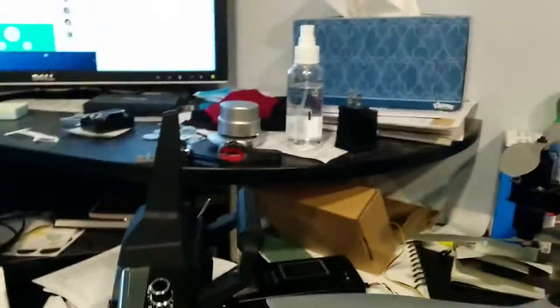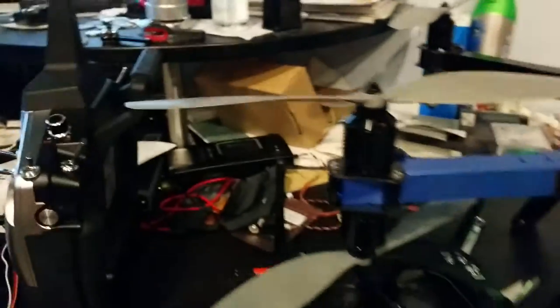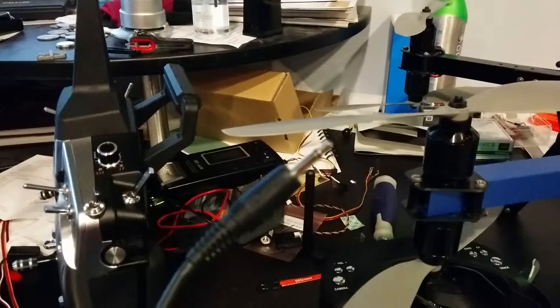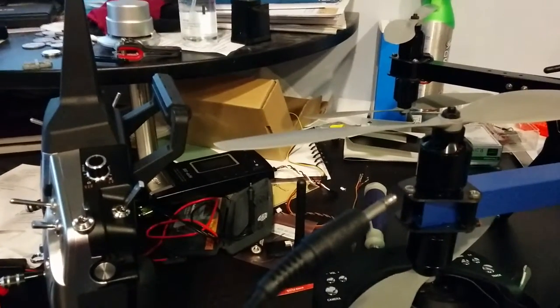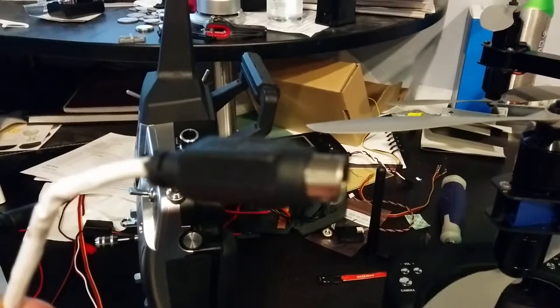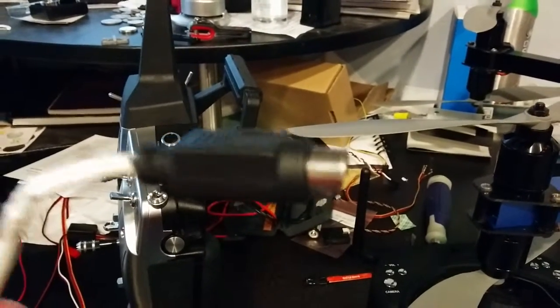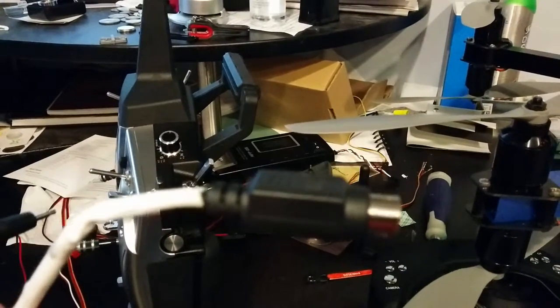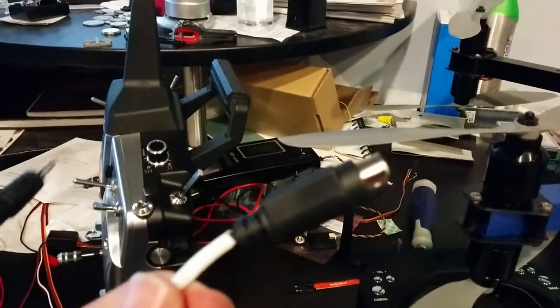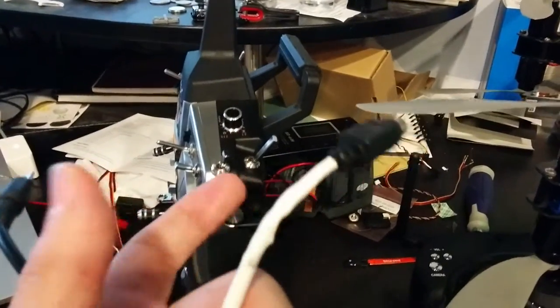Let's go ahead and show the head tracking, because that's the exciting part. We're going to take this cable that I have spliced up — it's a mono audio plug on one end, which is what the Spektrum controllers use. The tip is the signal and the back end is the ground. This is the head of the Sky Zone to JR cable. The JR cable is a stereo audio plug, which had an alternate pinout that did not work with the Spektrum, so I cut the cable and soldered it together with some help from my friendly local hobby store. We're going to plug this into the trainer port.